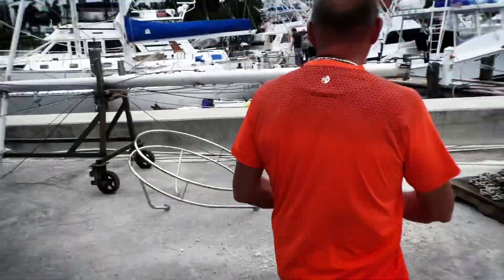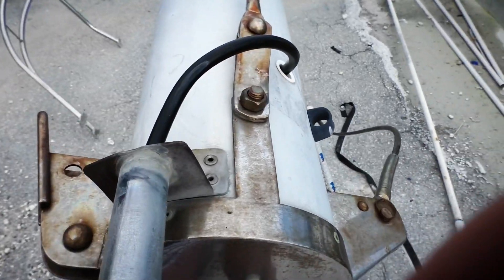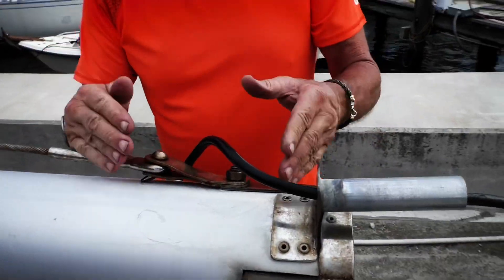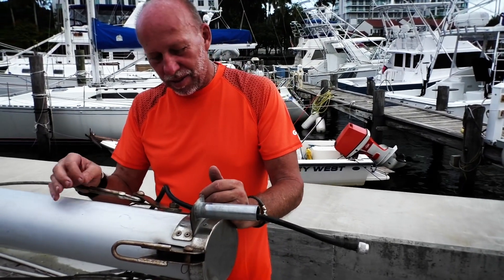Let's start out with where the mast connects to the rigging. Be sure to look at part two, where we're going to show you how we lowered the mast and got it from the top of the boat down to the stand. When we talk about rigging, it's attached at the top of the mast with a set of turnbuckles and stays. The cabling then goes all the way down to the bottom of the mast, which then connects to the deck of the boat. We're going to be talking steel boat — steel motor sailor. If it's a fiberglass boat, the only difference is that you're going to be bolting into your hull. Be sure when you're inspecting, look at every nut, every bolt. If you have any suspect, stop, pull it apart, replace it. It's much easier down here than way up on the mast.